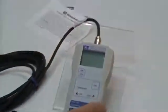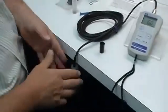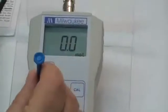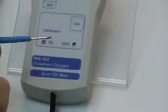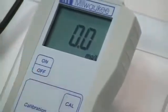At this point, according to the open air calibration procedure, you're going to turn your unit on with your probe and an exposed diode — no membrane. You should see a 0.0 come up on your screen. If you do not, use the provided screwdriver and dial it in to where you do see 0.0, not a negative or any other figure. This is what you want to start off with to zero the unit.